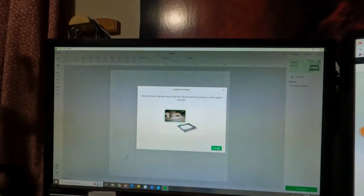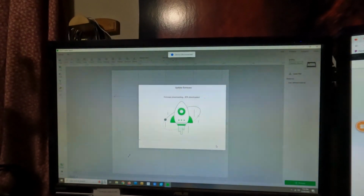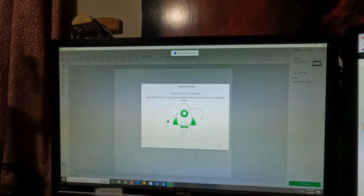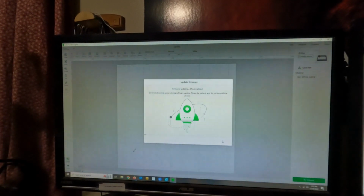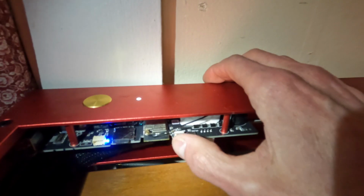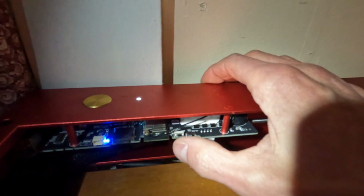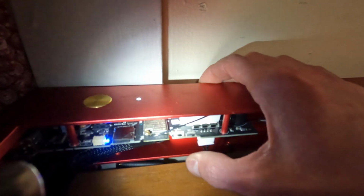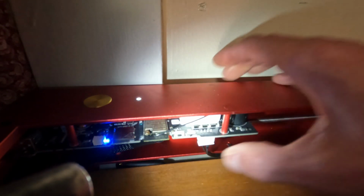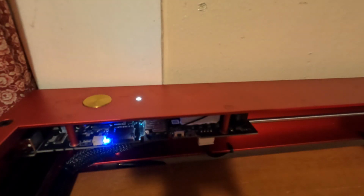After downloading the xTool Creative Space software from the xTool website, I plugged in the laser with the USB cable and it automatically connected, and I had to do a firmware update. In order to get the update to go through, there's a switch on the control board of the laser that had to be switched into the opposite position in order for the firmware to install. Once that was complete, I switched that switch back, and this laser was ready to move on and configure the Wi-Fi.